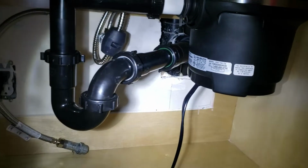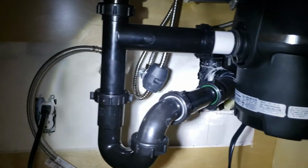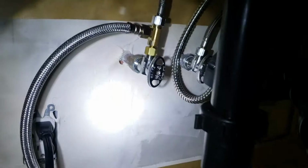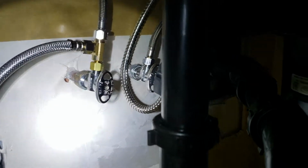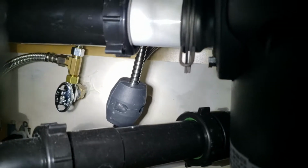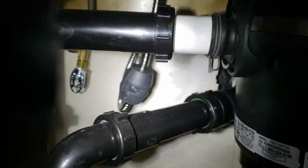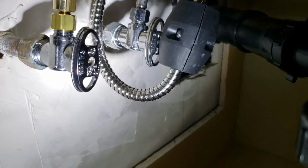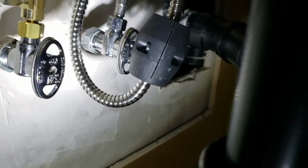We checked it out for leaks. Trap's not leaking. Water pipe's not leaking. The only thing we see back there is a little bit of a conflict. Your hot and cold water lines where they come in. You can see there that the hose for the faucet, for the spray hose, kind of drapes down and hugs the cold water shutoff valve. You can see the hot on the left, the cold's right behind it. So you may get some snags. It may inadvertently get hung up on that supply line. When you pull it up, it gets hung up on that shutoff valve, and it won't go up.